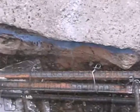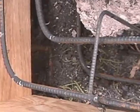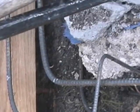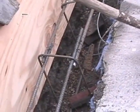You can see where one rebar starts and the other one ends. We have our corners over there that go around and make the corner. We do the same thing - go over six foot, tie into the next piece, over to the next corner. So really, when the concrete pours around all this, you're going to have one continuous piece of rebar.